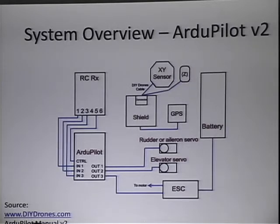As you can see here, we have an RC receiver on here — this isn't a completely autonomous system, it's best described as semi-autonomous. Takeoff and landing still has to be done manually at the moment. This is a problem the community is working on, but it's also important for FAA legal issues that we're able to take control of the plane for safety. For example, if the plane starts heading toward somewhere it shouldn't be, you can flip a switch and bring it back. The received signals go right into the Ardupilot, which connects straight to the servos and to the electronic speed controller — essentially our throttle. This provides filtered power for all devices, connects the battery, and connects to the motor which is our main thrust source. The GPS plugs into the shield along with our sensors — these are all the systems you need for a complete semi-autonomous autopilot.